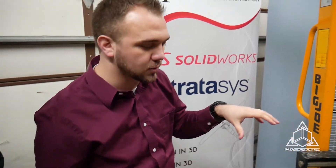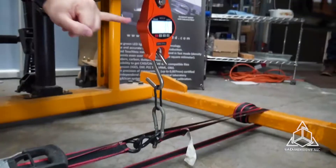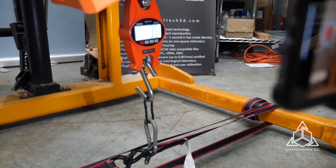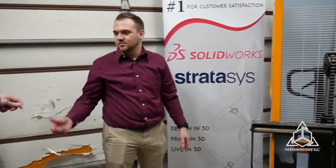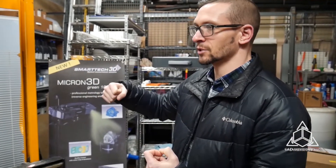Sure. We wanted to do a little better than water jugs, so what we did was essentially make a pulling rig out of Big Joe here. We've got one of our samples attached to the bottom of the lift, and then we have a force gauge to measure how much force we're applying to the sample part. We're lifting that up with the forks and will gradually crank it up and record when it breaks. Now, this first one is the band printed vertically — we don't really expect it to have much tensile strength. I'm expecting this one to break pretty immediately since it was printed in the wrong direction relative to the layer lines.